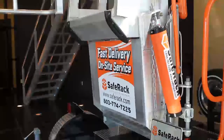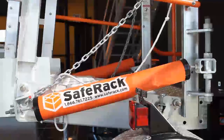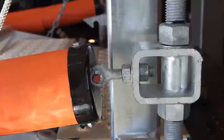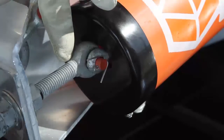The last problem you could be having with your gangway is it wanting to pop up before it gets to the mid-range position, and beyond the mid-range position, falling down. This is one of the most difficult problems to fix, but there are three adjustment points you can work with on the gangway: the spring yoke assembly, the eye bolt assembly on the inboard side, and the eye bolt assembly on the outboard side of the gangway.